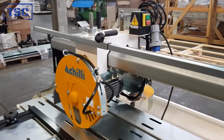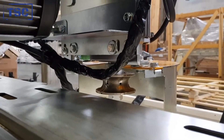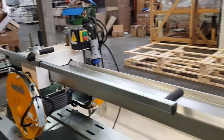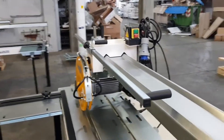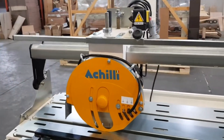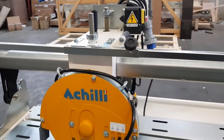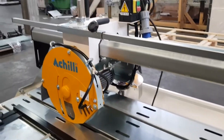Slot device blades are 200 mm in diameter, and shaped wheels with a 22.2 mm bore can also be mounted. In addition, the ANR can accommodate multiple blades divided by special spacers for processing skid-proof grooves on step surfaces. On special order, the saw can be manufactured with a longer shaft electric motor, permitting use of more blades together to perform grooving work. It will not be possible to cut all the way through the stone when using multiple blades, but just carry out surface grooving.